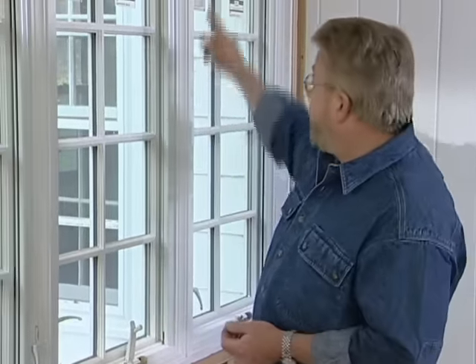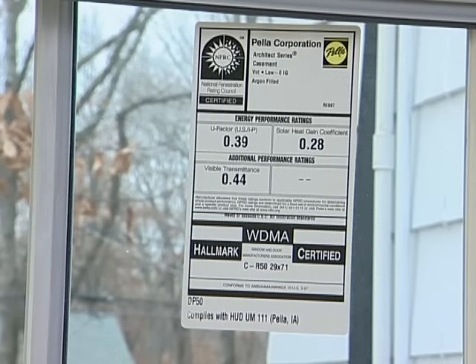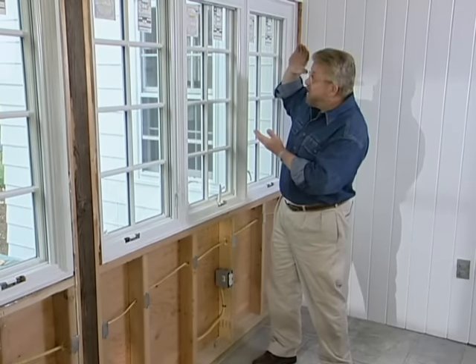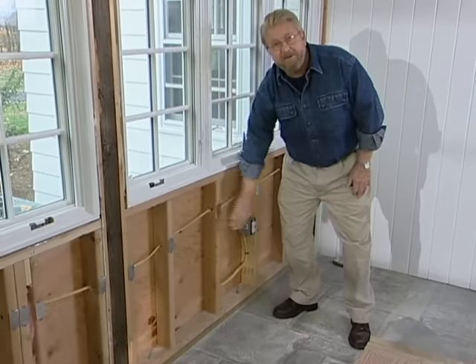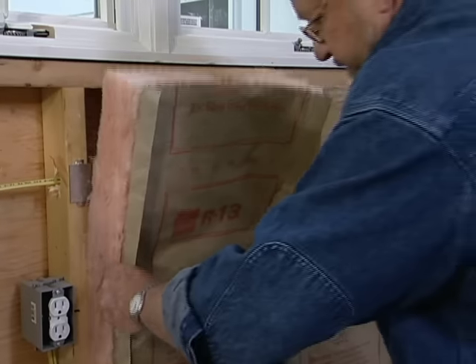These windows are state-of-the-art when it comes to sealing and insulation — two pieces of glass with the space between them filled with argon gas, an inert gas that helps keep heated air from passing through in winter and keeps hot air outside in summer. I've done about as good as I can in terms of insulation up here; now it's time to take care of the wall below, using batts of insulation cut to fit each bay.